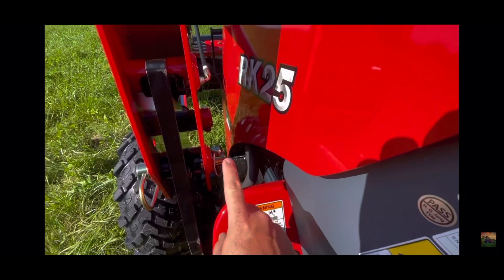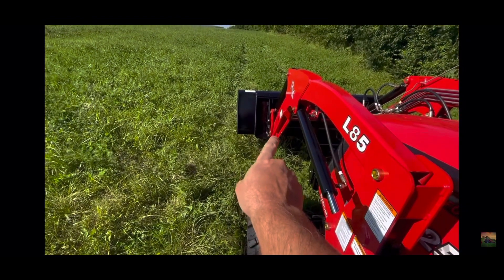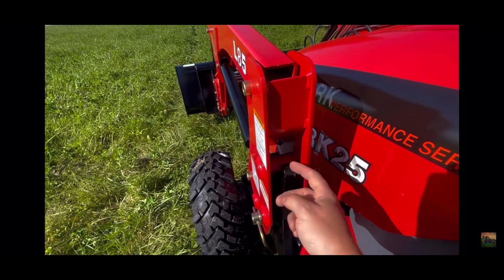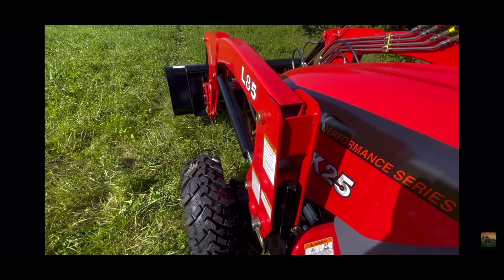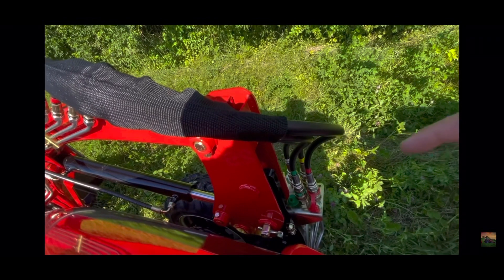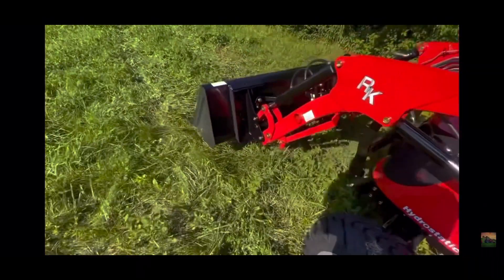On the back side you have a little pin — you pull that pin out and take this out once you set your front bucket and the legs down. Basically you're going to use the hydraulics to lift up off of this cradle right here, and that would allow you to back out. You would just pull the tractor backwards. You would also remove your quick disconnect hydraulics right here, and that's how you would remove the front loader.